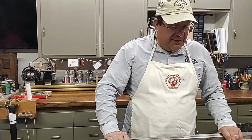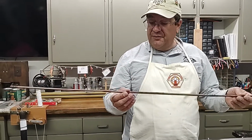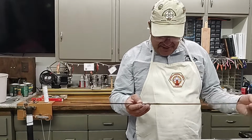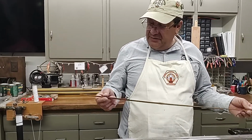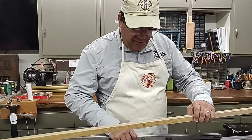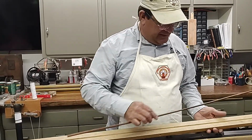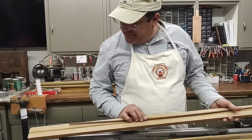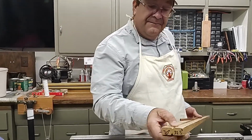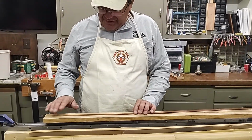Alright, so I was talking about planing the rods. At this stage, where I just have them soaked and I'll be pressing the nodes and everything, after the nodes are all pressed and everything's been straightened, I will go ahead and rough plane these. I use this wooden apparatus here, this planing form. It has 2 sides on it. The first side is to put the initial taper on there. And I'll put it this way in the form. It has a 30-degree angle and a 52.5-degree angle. And you only put this in for the initial angle. Okay, so I'll put that in this way.